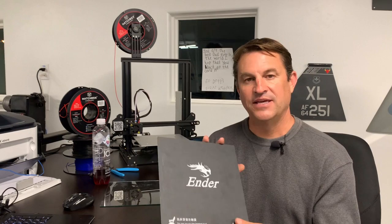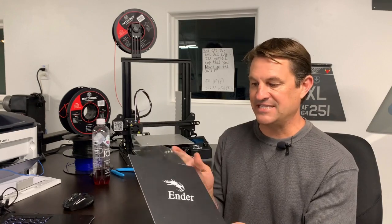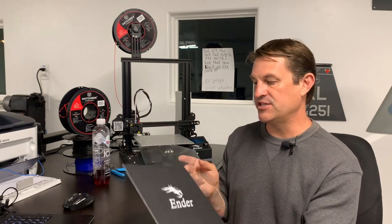If you look online, you'll see that there are a lot of folks doing modifications to their 3D printer. Since this was my first one, I decided to go with just a very generic build. The only thing I decided to change was this plastic mat that comes with the printer — this is where the part prints onto and it needs to be flat. But over time, this thing starts to warp and the part just doesn't stick to it anymore. So what I replaced it with was a piece of glass. I found this piece out of an old picture frame, took a Sharpie and marked around the edges, took a glass cutter, cut out this piece of glass, and now it ensures that every time I start, I start with a flat surface — which is really the most critical part when you're starting a print.